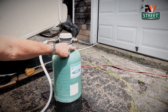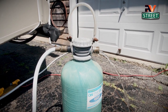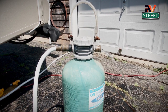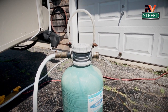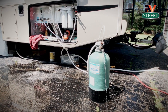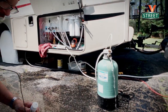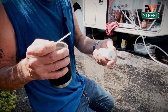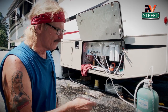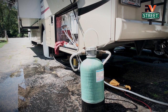Okay, this is the stream you're looking for — we're going to do this for about 20 to 25 minutes. So we've finished doing the slow rinse, which was a small stream about the size of a pencil. Now we're going to open that water valve all the way and let that water really stream through here — this is what's called a fast rinse. We're going to do this for about 10 minutes. Okay, so we've done a 25-minute slow rinse, and now we've done about an 8 to 10 minute fast rinse. Let's go ahead and test our water right out of the softener. We're going to take our test strip — this kind says to hold it in there for one second — and look, it's right where it needs to be. So now that we know our water is good, we're going to turn it off, hook up the hose, and we'll be good to go. Both hoses are hooked up, it's regenerated, we're good for another three months.